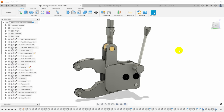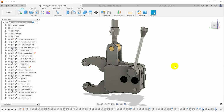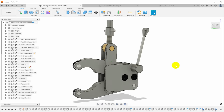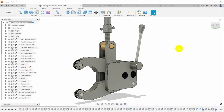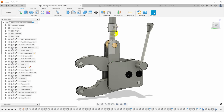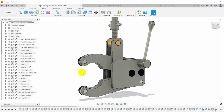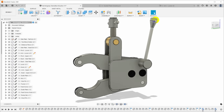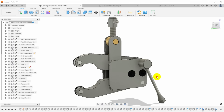If you haven't seen one of these tools before, this knurler is patterned after an older design made by Marlco and has a lot of the features of a typical clamp knurler - two arms and some kind of screw pressure assembly. But what makes this one unique is there's a lever and a cam in this back joint so that while you can turn the screw to raise and lower the arms, you also have this lever and cam that you can use to clamp onto the workpiece and release it repeatedly.